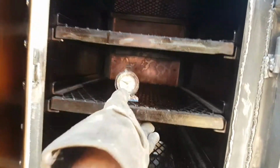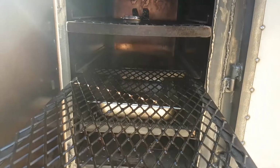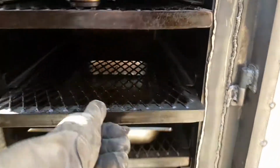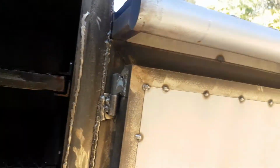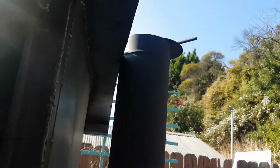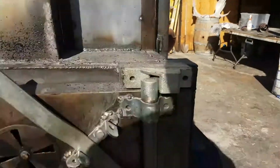And we got 6 racks here. So all of this is just 1-inch angle iron, all the racks, welded together with expanded metal on top. And let's see, we've got 6-inch chimneys on each. It's just Home Depot. I bought the 6-inch smokestack stuff they sell and made some swivel lids on the top. They just have this compressed spring holding it down, and they just pivot on one bolt basically.